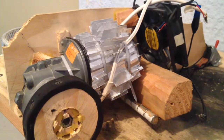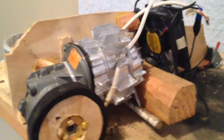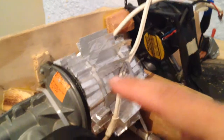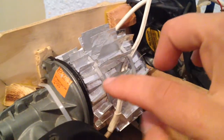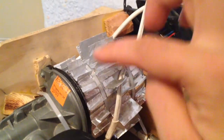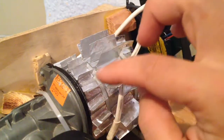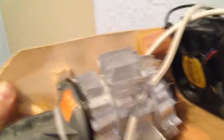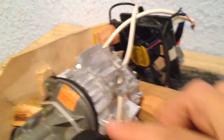Now I have installed all the cooling fins on the motor. I went with larger fins for the center of the motor — this is actually where most of the heat is produced. Right under here you have the armature and the windings in the center, then you have the magnets. I think this is going to dissipate the most heat. I also have two rows of smaller fins and the fins go all the way around to the bottom as well. This will increase the surface area and allow the fan to pull the heat off the motor more effectively.